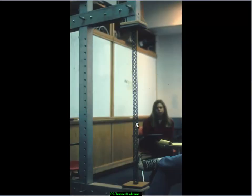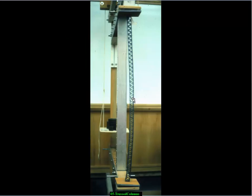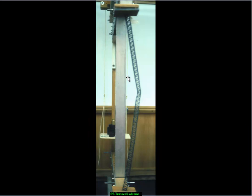Okay, so we did this study. We made some slender columns, subjected them to forces, watched them buckle. So this is the initial stages of overall buckling, which is occurring for this fairly slender column. And of course, once it starts to curve, you get an induced moment, and the compressive forces on this side are very large. And in fact, at this point in the failure process, we probably have tension on this side, which is exaggerating the problems on this backside. And eventually, when failure occurs, we get a kind of crimp of this sort. But this failure was initiated by overall buckling.